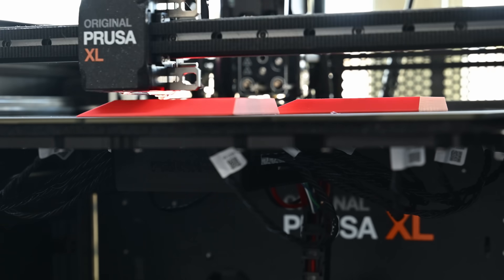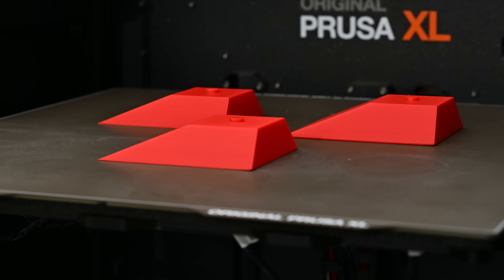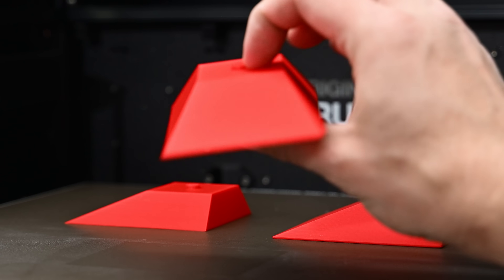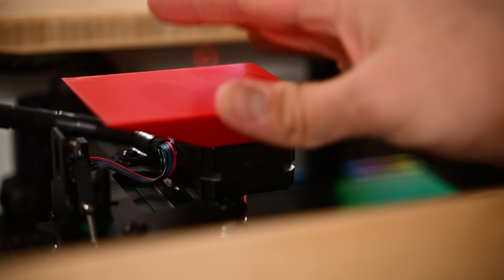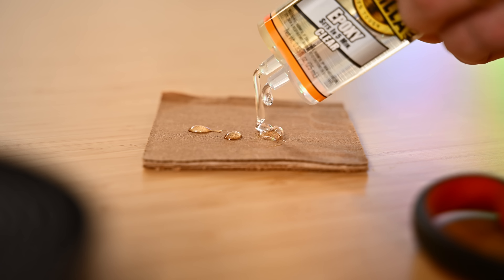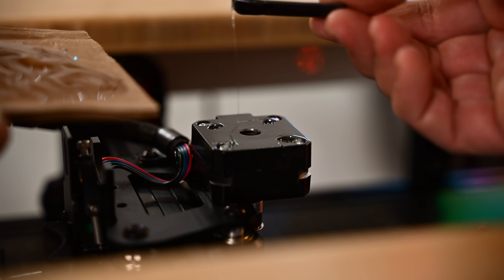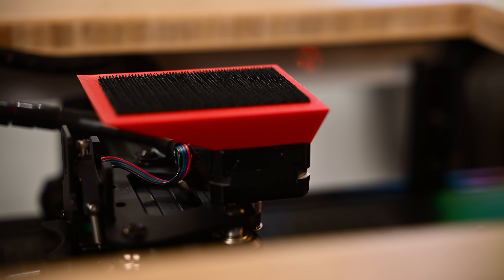With all the software complete, all I had to do was affix the mouse pad to the contraption underneath. I designed and 3D printed a little mounting point so it just plops down on there - that's satisfying. I decided to go with Velcro to make sure I could move the mouse pad around if I needed to adjust it, and then I epoxied my 3D print directly onto the back of the motor. And then it was done.